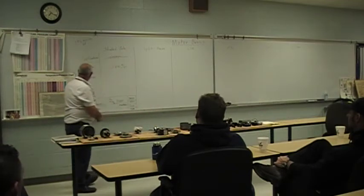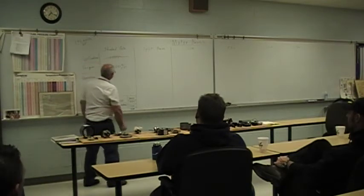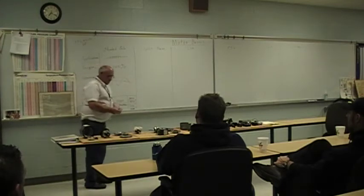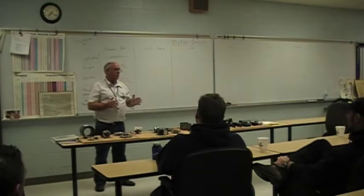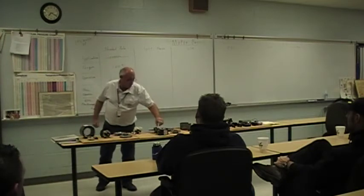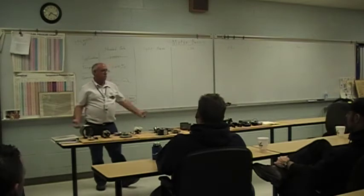Very simple operation, very basic. If you look at the sine wave, what happens is you have the sine wave coming in like so. If it doesn't have that shade in there, there's nothing to offset that magnetism so it'll start turning. It's kind of like a cart with both people pushing or pulling opposite of one another - nothing's going to happen, it's just going to sit there. You put that little bit of shade on there, change the magnetism that's induced in there, and you get the rotation started. Very simple.